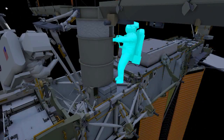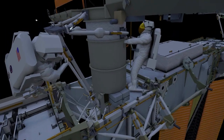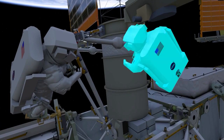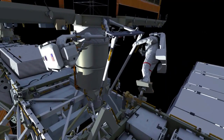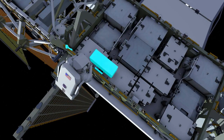the mid-strut install. Thomas will translate on the mid-strut and drive 2 collar bolts to torque, rigidizing the telescoping mechanism on the right-hand side. Once complete, the crew will install the multi-layer insulation, and then Thomas will position to the left-hand side to repeat. Aki will egress the foot restraint and begin cleanup. He will retrieve and stow all the tools, fold the bag in thirds, and stow on his body restraint tether.